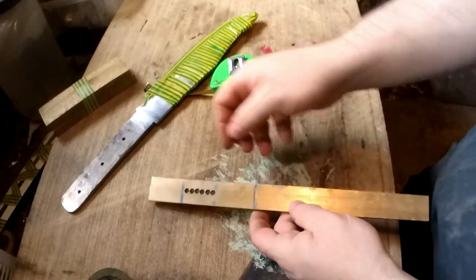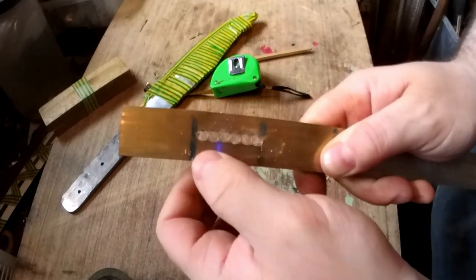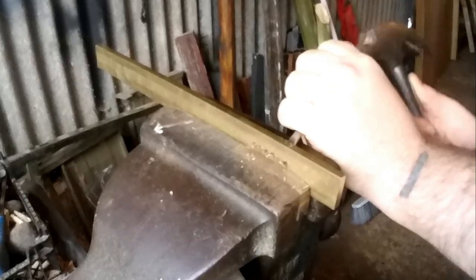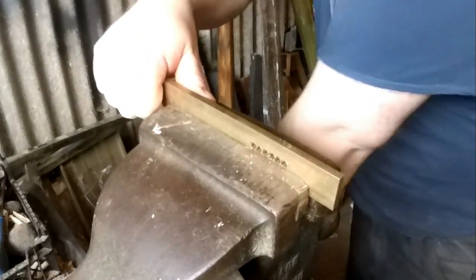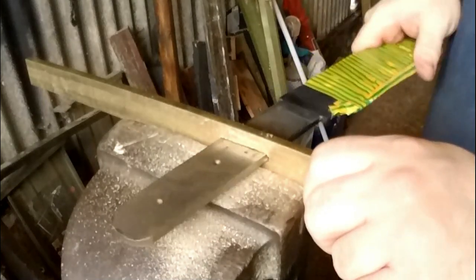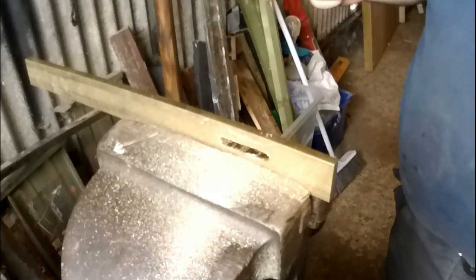Right, so I'm now going to get a screwdriver. See those lovely drill holes as well, where I punched it, it's made those really close. That'll make this really easy now. So just put it in the vise, hit between there with a chisel or a screwdriver, and then start filing it. So just keep going around till you've basically got a hole big enough to get your file in. Won't take long. Yeah, as I said, if you get the right brass, this stuff is absolutely lovely to work with. Right, there's a little bit more, and then we can start shaping the actual guard.